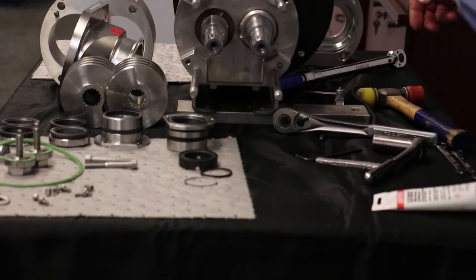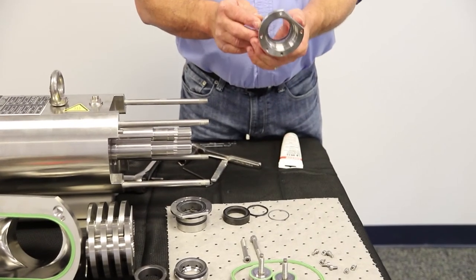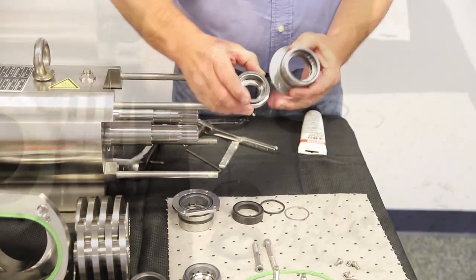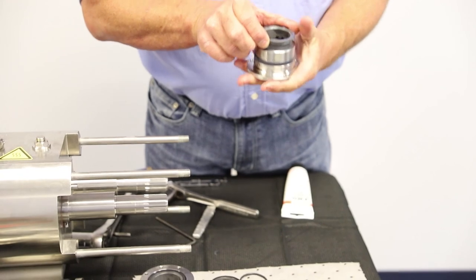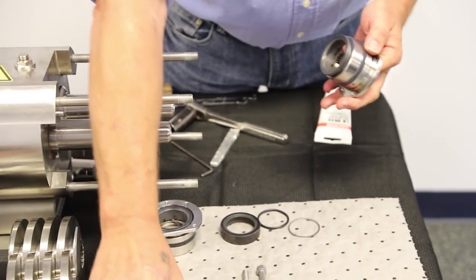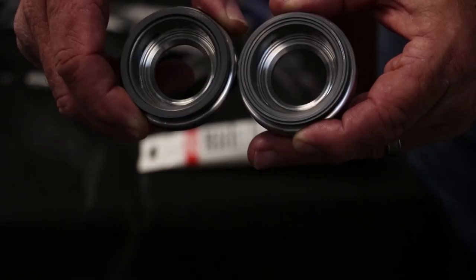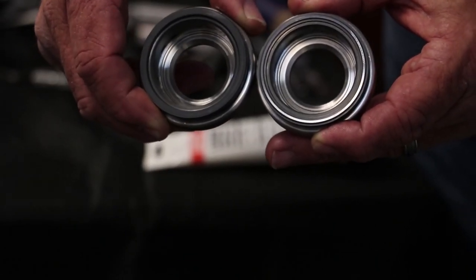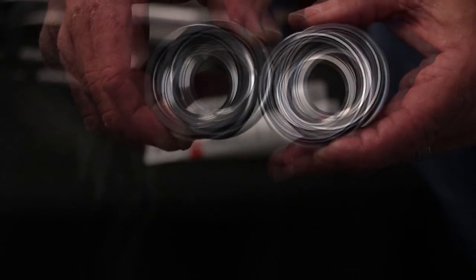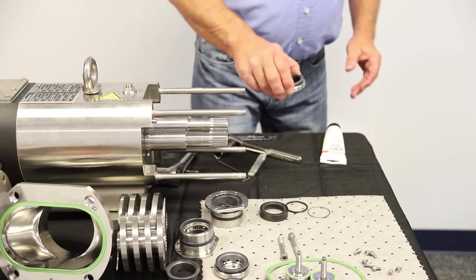When using a single mechanical seal, the process liquid will be used for seal lubrication. In this configuration, the recommendation is not to run the pump dry of process liquid. When it is necessary to run the pump dry, a double mechanical seal with flushing capabilities is recommended. This flushing media can be any process compatible fluid or steam sterilization for aseptic processing. If using a flush seal for dry running is not an option, it is recommended to use the tungsten carbide knife's edge seals. The difference in seal width decreases friction on the seal faces during dry running; however, this is for short periods of operation only. Long term operation will result in damage to the seal faces and elastomers.